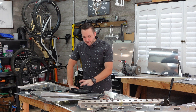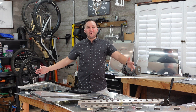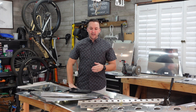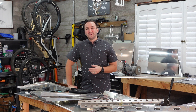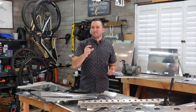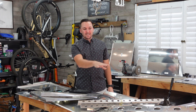Fast forward to now with this recent statement — knowing my experience with those fuel tank stiffeners and the high likelihood of cracking — I'm sitting in front of 42 parts for my fuselage kit. Every section involves some kind of laser cut part. A large majority of my kit is going to have laser cut parts. Looking over them, all of them share inconsistencies in the holes. I stopped the flap build and went through pulling everything apart to find all the major laser cut parts. These are the big components of the fuselage, and we're going to be using them in the very first section.